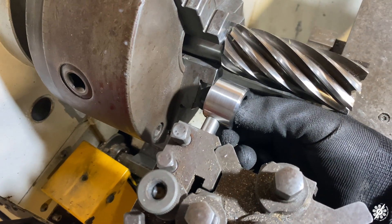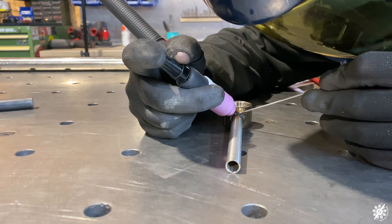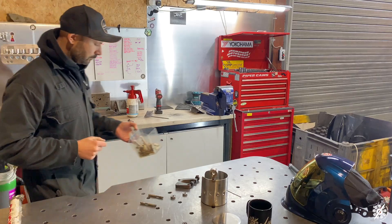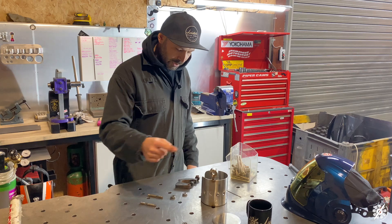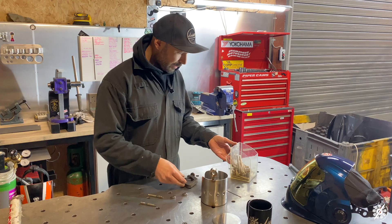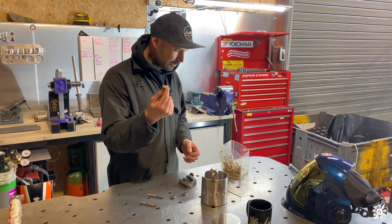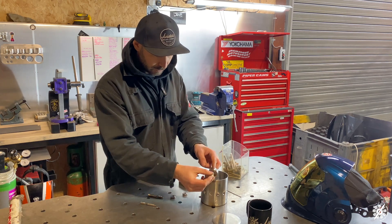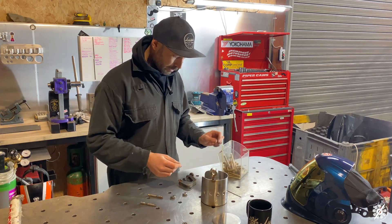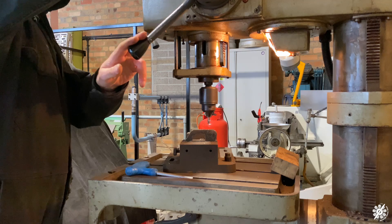Well, you're not having an end mill the right size but that's close enough. That's what I did in there. Next thing is to make an axle to bolt it all together — so that goes on there to that. I've got some nice 12-point high-tensile steel aircraft bolts which look pretty cool, so they'll bolt through there to hold it all together. They're 5/16, so I just need to drill and tap this to accommodate it.